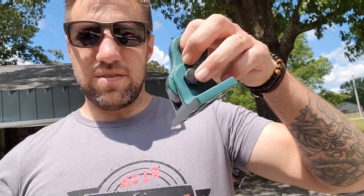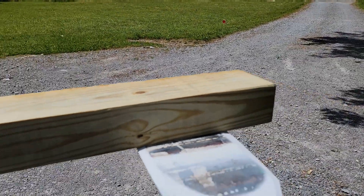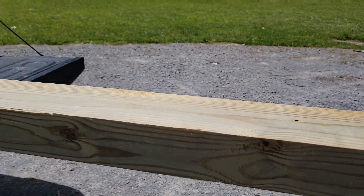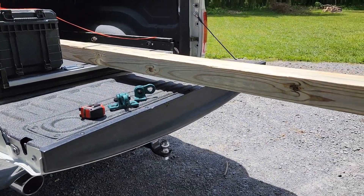I'm back real quick. I did find my selfie stick, which is awesome. So here's what we're using for the swings - these are actually made for swings, they're freaking huge honestly. We're going to lay this out to where the swings go. I know my swings aren't coming until tomorrow, but I know they're 26 and a half inches wide. We measured the bracket, so we're basically going to come in 12 inches on this first end so the board will go all the way in the bracket, and then we'll probably come over a foot and start laying out the swing brackets. Hopefully we've got enough room to put Kinsley some monkey bars on the end.